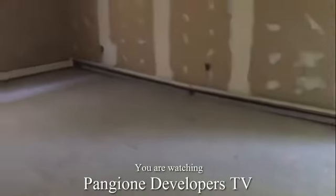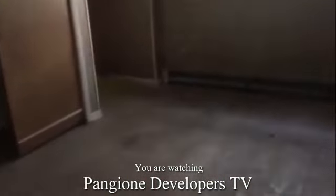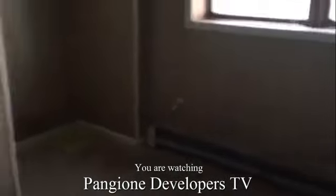We're going to put a French drain in around the perimeter of the basement. You can see there was some water in here, some mildew, mold. Pulling all this out. And once we put our new walls in, we will have a nice tile floor in here. We don't have to worry about any water because we'll have the French drain all the way around the perimeter, which I like to tell my customers to do.